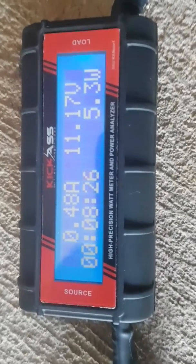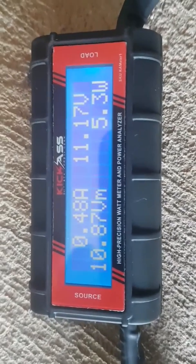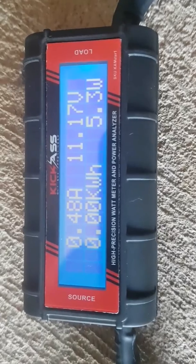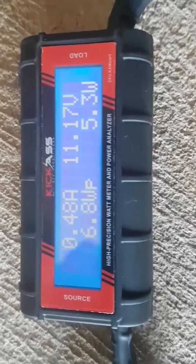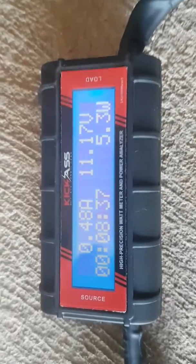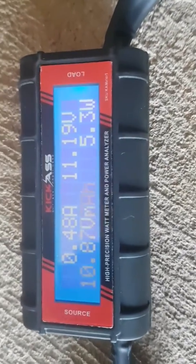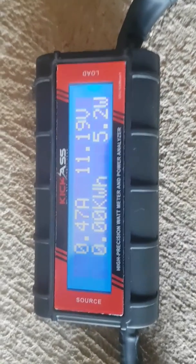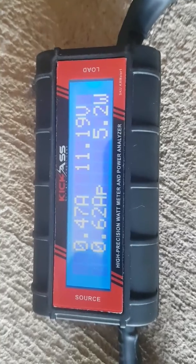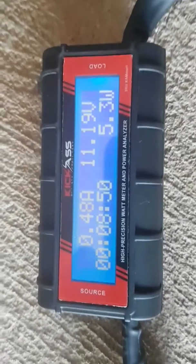The other reading is kWh, which is total watt hours. It keeps a tally of how many watts have been put out from the time it was connected. It'll just keep going and keep a tally for you, and you can check in any time you want. In reality, it's keeping track of what's going in and what's coming out of the panels.